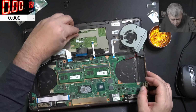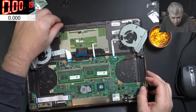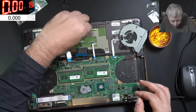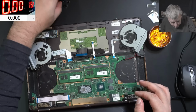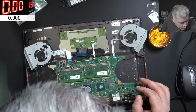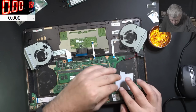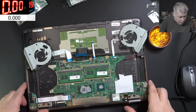So the AC chip was shorted. Yeah? No, the 3.3 was missing, yeah. And this chip was getting hot. Yeah, now I remember. Okay, let's cool the board. And we can test with the meter, yeah? USB meter.